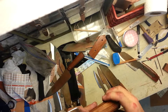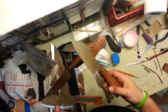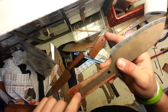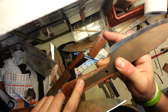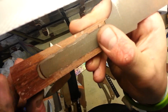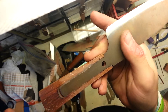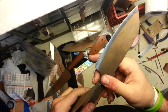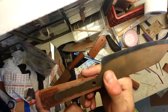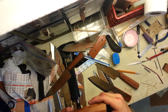This was kind of a frustrating couple of days here because I made three of them — here's one of the santokus and the other one — but I made these three handles and then snapped one, split one in half completely. I had some sawdust mixed with vaseline stuck in the bottom of the knife, and it was causing the knife to sit up here instead of all the way down. Stupidly, not paying attention, I tapped it with a claw hammer instead of a rubber mallet and just put too much force on it, and the epoxy popped off both sides.